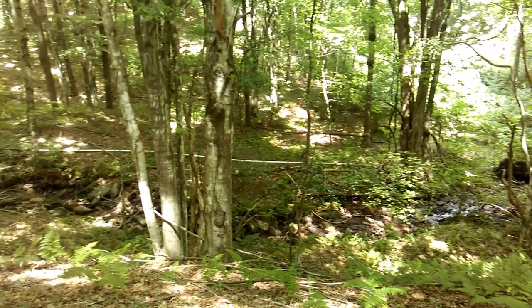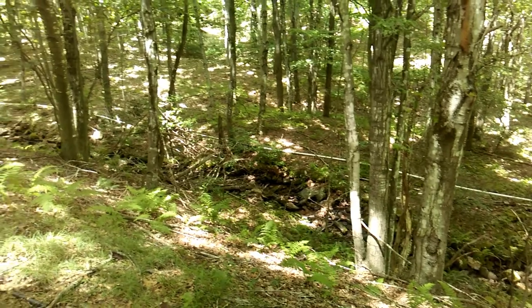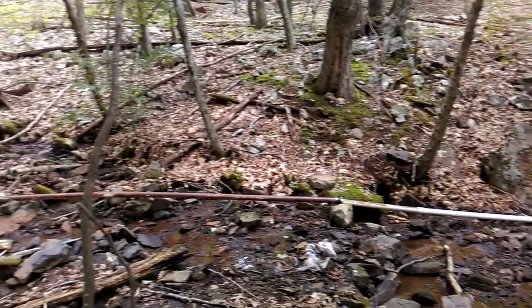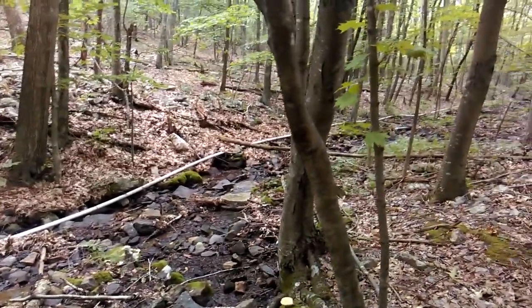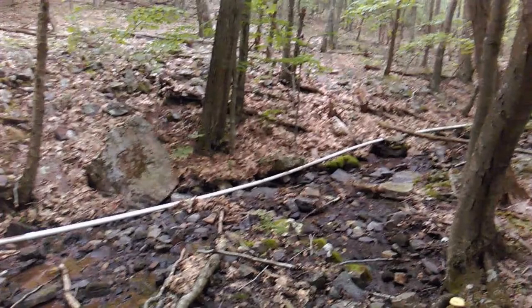For me, managing and comprehension of the hydro turbine system — the hardest part has been managing the civil engineering of that big pipeline up the hill. That's something that really needs a lot of attention. If you're going into hydro, do not scrimp on thinking your way through the water, the penstock, the pipeline part. Because that's a part that's going to be a nuisance, and depending on your situation it could be catastrophic.